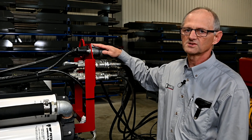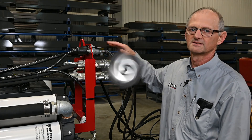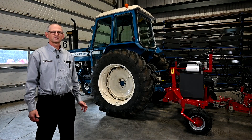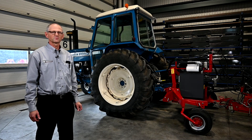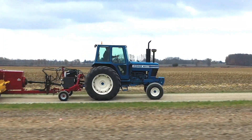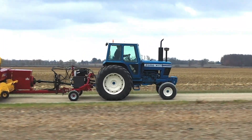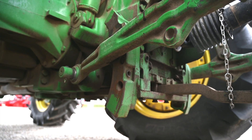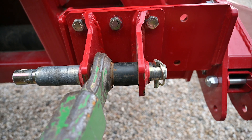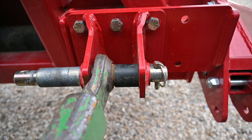The light plug is also mounted in this location. Now I will talk about setup. It is important that the stabilizer bars are installed and properly tightened. This is critical when traveling at high speeds on the road. If the tractor doesn't have stabilizer bars, the three-point hitch arms and sway blocks need to be adjusted to ensure there is no side movement.